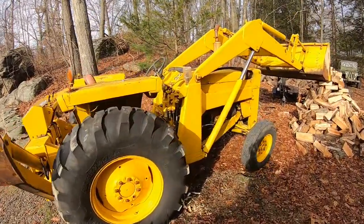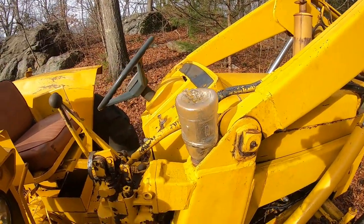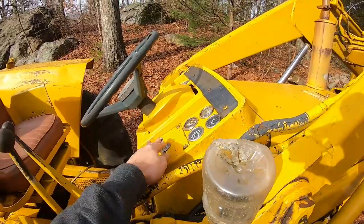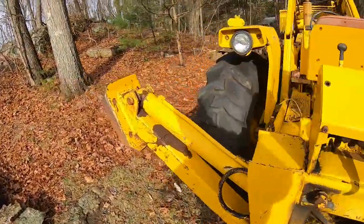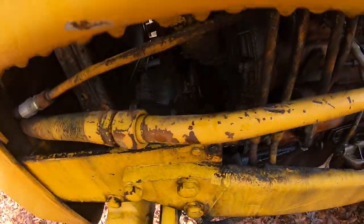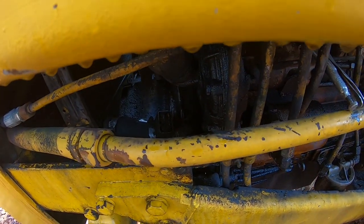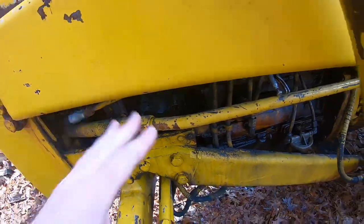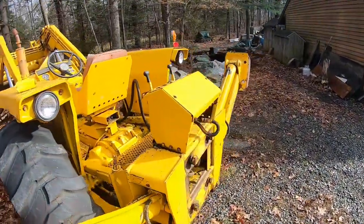Today, I'm going to try to get it running and get it out of here so I can do some work, because it's actually kind of a nice day today. So we're going to put a new throttle cable on it. The other thing that happened the morning they tried to move it is it's got a block heater down here. Maybe you can't see it. It's actually not a block heater, it's an inline coolant heater, in line with the lower radiator hose. That melted, so you can't heat up the block at all.